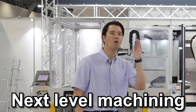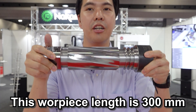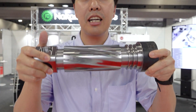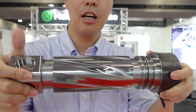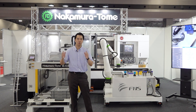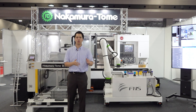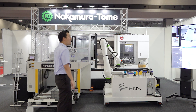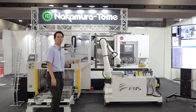This machine's main concept is the next level of machining. Look at the machine's name — SC-212L. What does the L mean? L means long bed. We have enough distance between spindles, so we can put long shaft workpieces. This machine also has X, Y, and Z axes. The Y-axis is suitable for milling, so we do machining from material to complete parts on one machine. If you combine many processes into one machine, it's a very good fit for automation. Because if you have many machines and want to install automation, you need big systems and many robots for many machines. But with our system, one multitasking machine combines many processes from material to complete parts — all you need is one simple automation system. This is the key point.